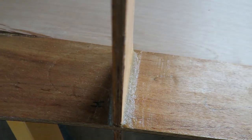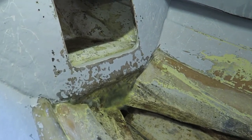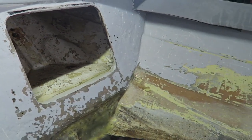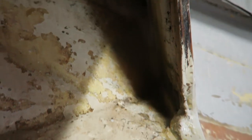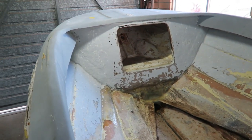With the leftover resin I've been working on the front of the boat. One thing I've done is glass in that hole at the bottom as already mentioned. The inside edge here is actually a gap through the floor, so I've put some mesh in there and coated it in thickened resin — I'm going to come through and glass the inside of it. That's added some structure to either side to make it a lot easier when adding the glass — basically given it structure to stick to.